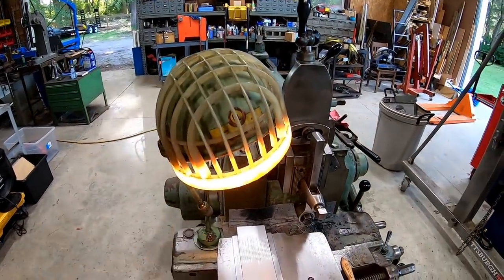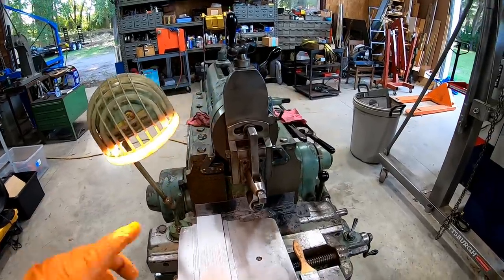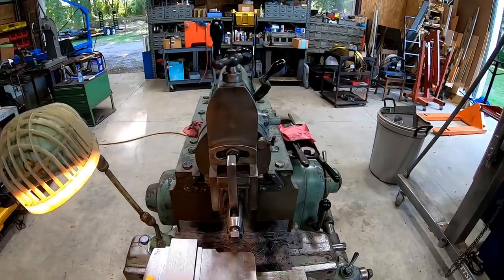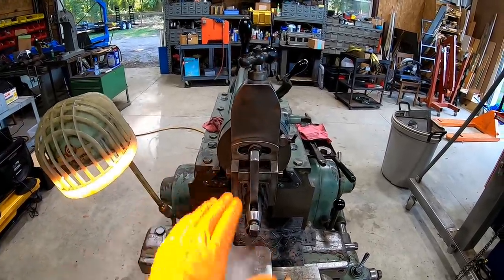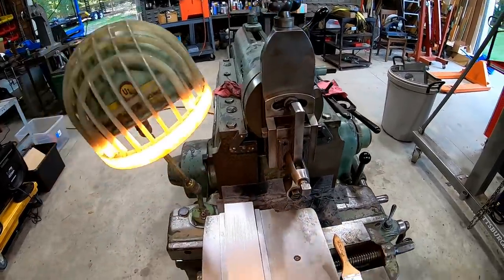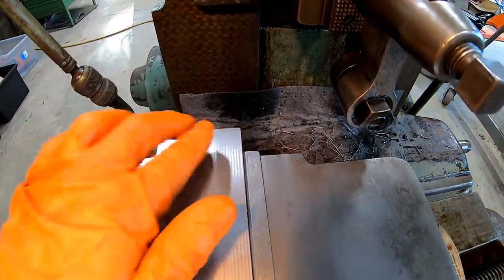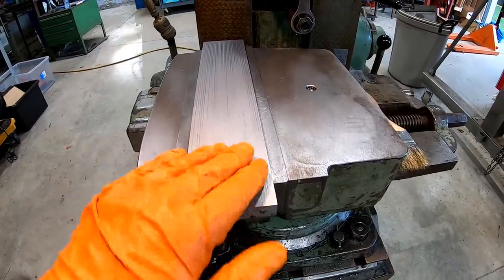You can see it right here, down the motor. The motor is vibrating real bad, but he obviously found a little bit of wear in the ways. Right. The ram ways, which we've got the gib adjusted and as snug as we can, but we already know that there's give and wear in the machine just because of its age and its use. But it just looks gorgeous back here, and it's so smooth. And just a little bit deeper between the cuts out here.